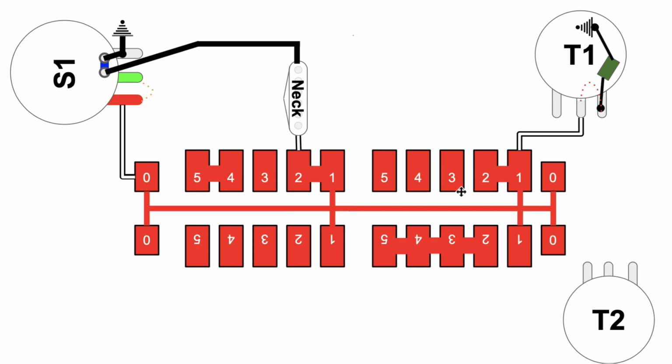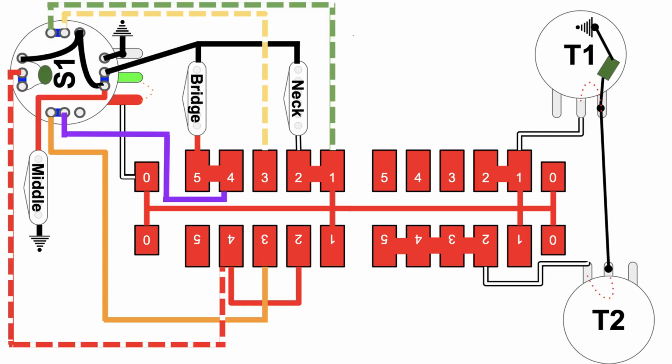And then from the backbone, some of the audio can be impacted by this tone pot, so the audio comes in this way and goes through the middle tab of the tone pot over here to this tab, through the attenuation of the tone pot, through this capacitor, and to ground. To the extent that the first tone pot impacts the audio sound, this is what's happening there. And then if we come way over here, it also goes this way to the input side of the volume pot, and then it goes to this bright green tab, which leads you over to the output jack. So in position 1, with the S1 button up, it's simply the neck pickup and the one tone pot in play. Let's go ahead and reset the whole circuit